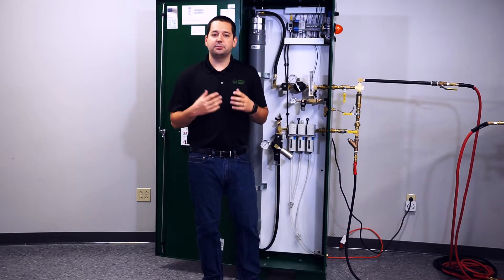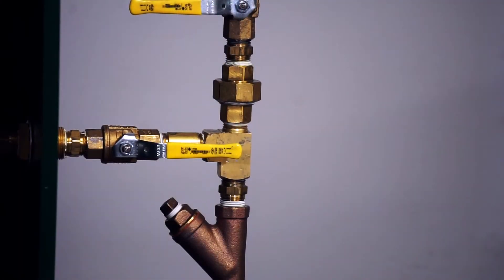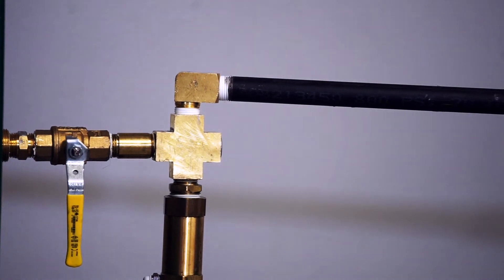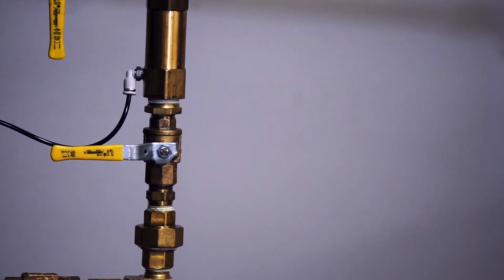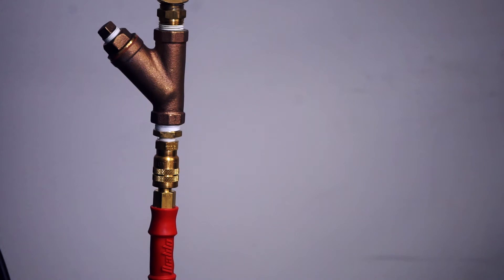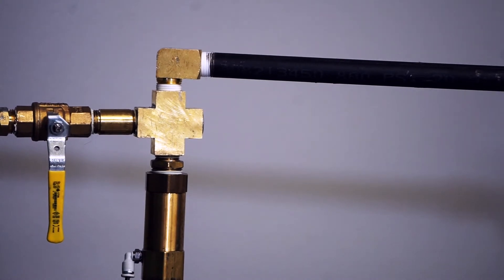The last thing I want to talk about here is actually plumbing the nitrogen generator. If we come to the outside of the cabinet here, we have a set of three valves. The valve on the bottom is actually your inlet to the cabinet — this is where you want compressed air to come in. The top valve or top line connection is the outlet valve — this is where the nitrogen goes out to the sprinkler system. The valve on the side is your bypass valve, used to provide compressed air to a sprinkler system in case of a fast fill situation. For an installer, we hook up compressed air at the Y strainer on the bottom of the bypass assembly, and on the top of the bypass assembly there is a half-inch connection that connects to the dry or pre-action sprinkler system.